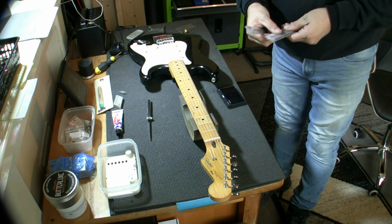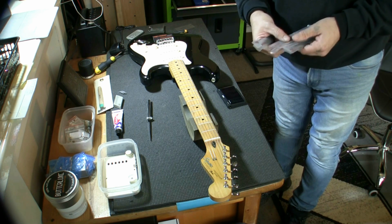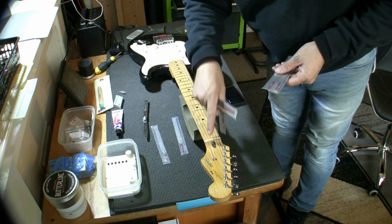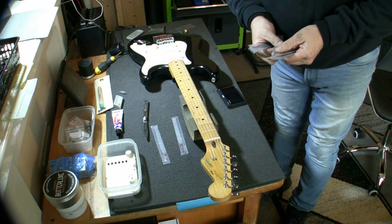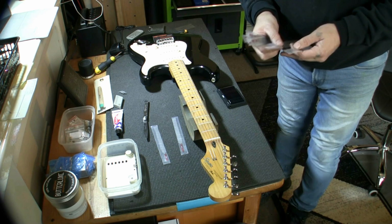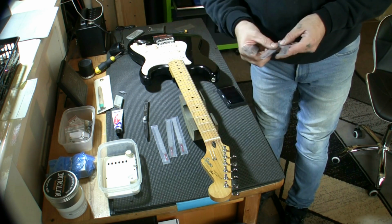I'll get as close as I can. I know, for instance, we do have a 9. Do we have a 9? No, we don't have a 9, so we'll go over to 10. We don't have a 15, so we'll go with a 16. We don't have an 11, so we'll go with a 13. All standard fare. So we've got a 10, a 13, and a 16 for a 9, 11, 15.